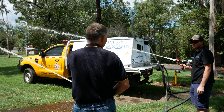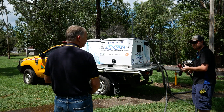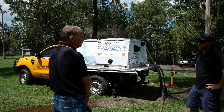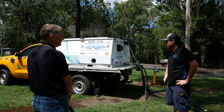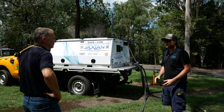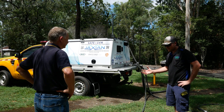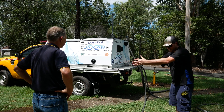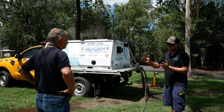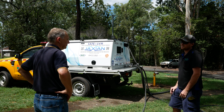The weight of the actual pump unit itself — roughly about 80 to 100 kilos depending on the batteries you put in it. With 22 batteries it can be anywhere from 100 to 120 kilos — and that's including the battery. Compared to a medium truck, the engine alone is talking 400 to 500 kilos. Then you've got the two pumps — somewhere near another 400 to 500 kilos — plus all the plumbing to the front, the manifold on the back, all the gauges. That's at least another 100 to 200 kilos.